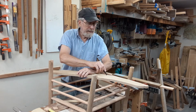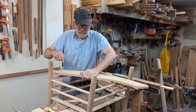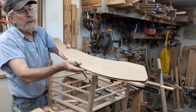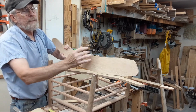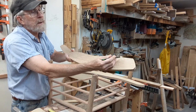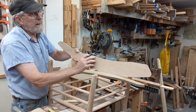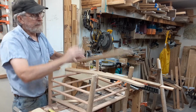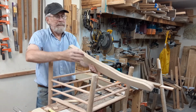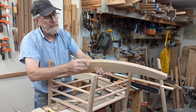And you could just use the rocker here, or you can use the pattern board. And it's not very much wood, but I'm going to cut that out. Remember I told you didn't have to do anything in this area when you were smoothing up your rocker. I'm going to cut that out, get that radius closer to the leg. I'm going to do that on both rockers. Okay? And I've got my end mark right there. That's going to get sawed out, but I've still got my mark on the bottom.